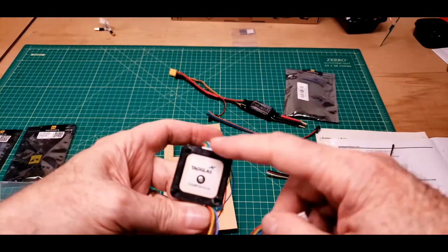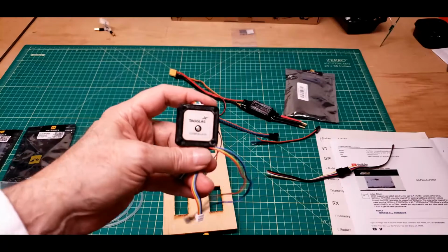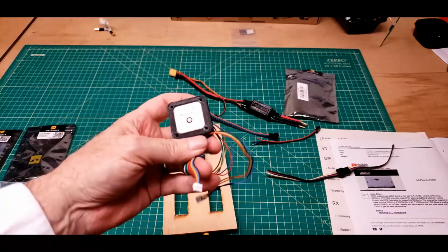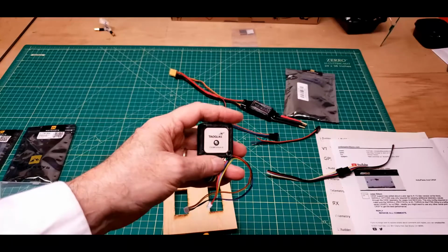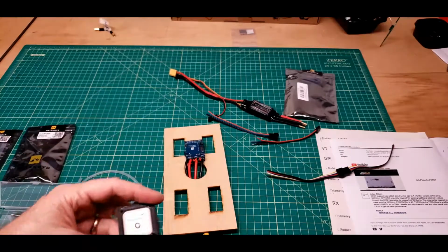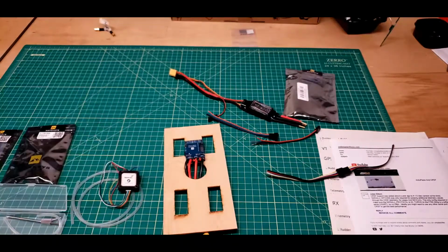They'll go back to the flight controller. So the airspeed sensor will be sent through the I2C bus of the M9N 5883 GPS, which is multiple constellations and should pick up a whole lot more sats than any others that I have. That's why I got these, to play with a multi-constellation GPS module. What else? Nothing more here.